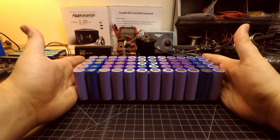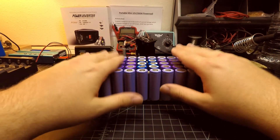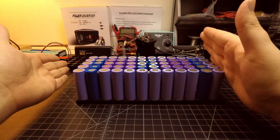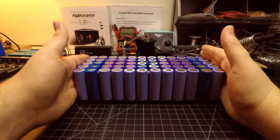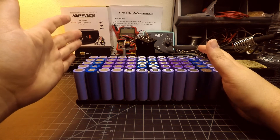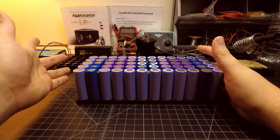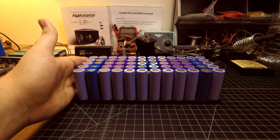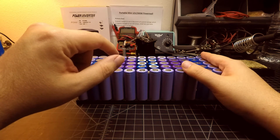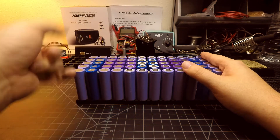So that's a look at the batteries, how well they've tested, and what's going into this 12-volt source. I'm expecting the capacity of these 60 cells to be somewhere in the neighborhood of 450 to 500 watt-hours — quite a bit of power. It can run even a modest 100-watt load, like a fan and an LED lamp, for four to five hours easily. You can see the inverter back there, which we're going to talk about in more detail and unbox in the next video.